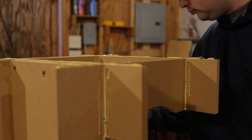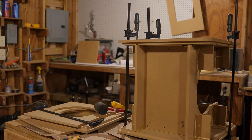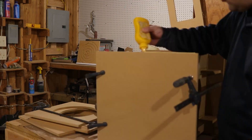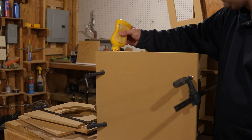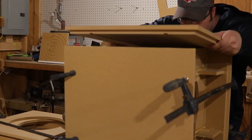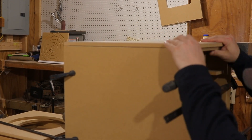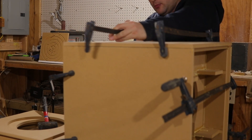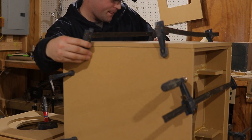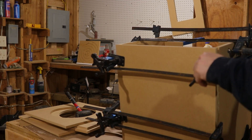The flat pack itself doesn't come with any instructions — there are just a few diagrams showing what piece goes where. These cabinets have a little CNC tolerance built in, which means you probably don't want to tighten down your clamps all the way until all the pieces are fit around the cube. It's really best to glue the entire outside of the cabinet all together at once and make sure you have enough clamps on hand.